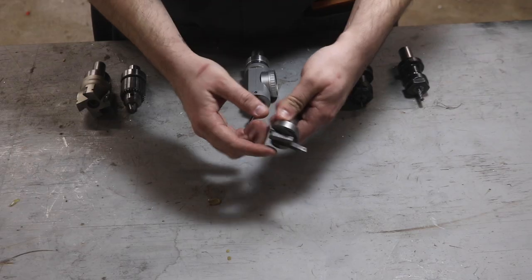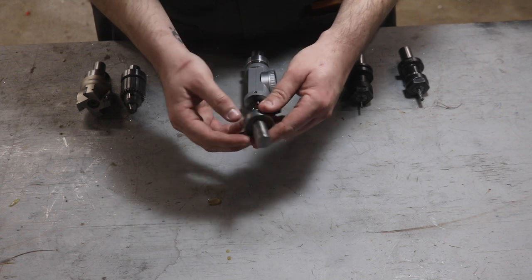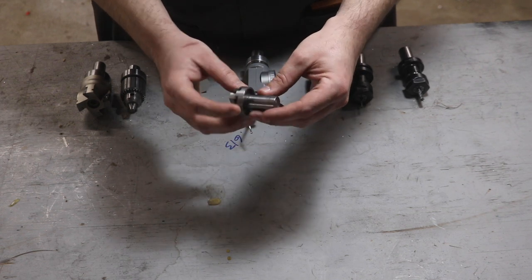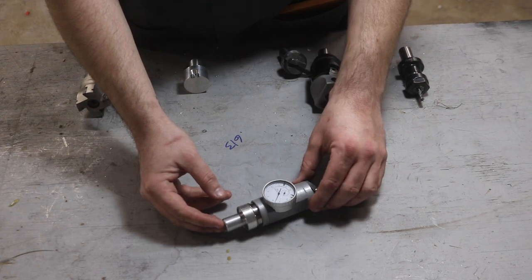It uses the TTS system so it's basically like a little micro Tormach superfly. This is a little indexable carbide lathe tool and I've cut it at an angle here — this is just mild steel. I've cut the groove. Of course this isn't hardened or ground. It's usually just for finishing.